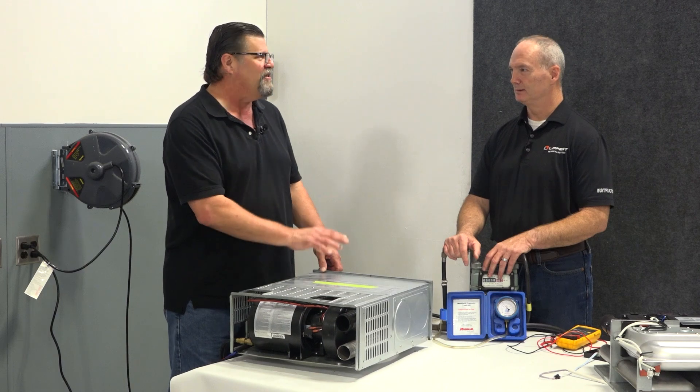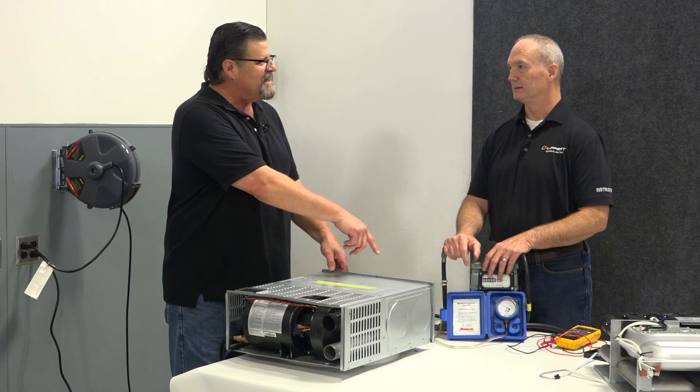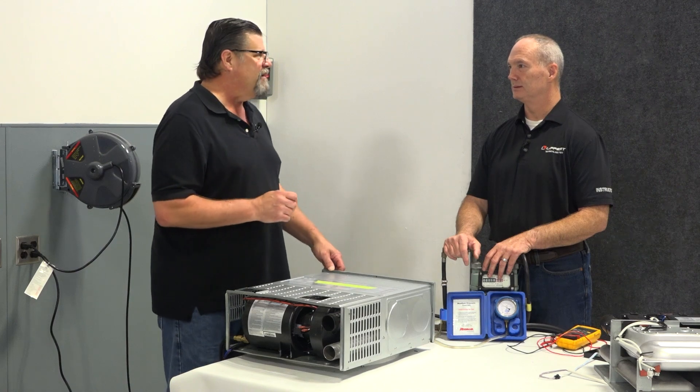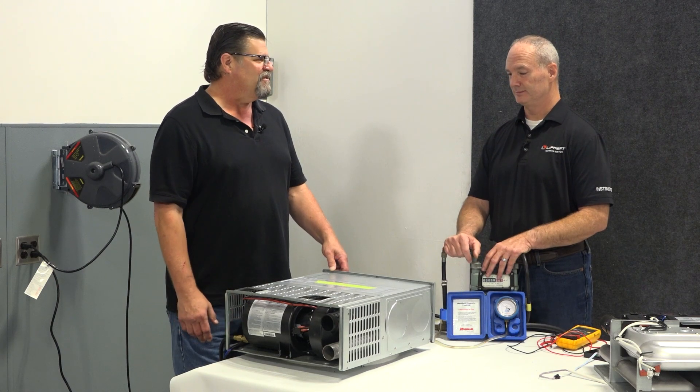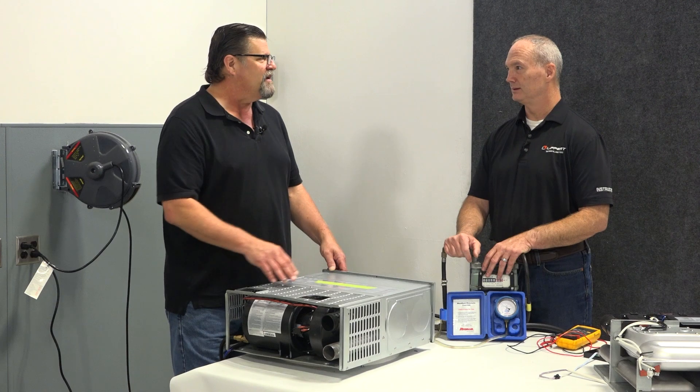That's one of the things you really want to pay attention to. If you're dealing with a furnace that's short cycling — it seems like it's turning off on the burner — when that ECO limit switch resets, you get a little pause of about five or six seconds. If you hear the burner turning off, then a pause, then the burner comes back, the fan turns on, and it goes back to ignition, you know the limit switch is tripping — you're dealing with an overheat situation or a bad limit switch. Take the extra minutes to listen, because it'll help you a long way when troubleshooting.